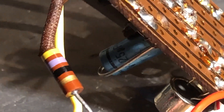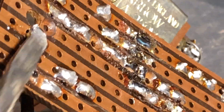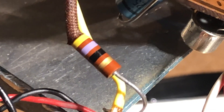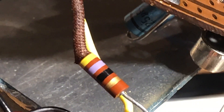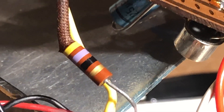This resistor here is normally 2.2 megs and it's a shiny, brand-new NOS-condition Allen Bradley carbon comp — it looks like it's been replaced. I'm going to unbridge these traces. This 47-ohm resistor just seems wrong — that would make this thing ridiculously loud. I've never seen a germanium Zonk that didn't have a much higher value resistor there. We'll see if it fires up and biases, and if it needs taming I'll put a 2.2 meg in.